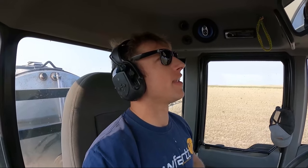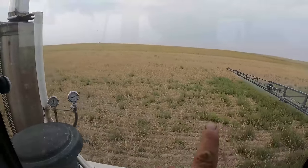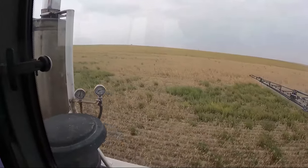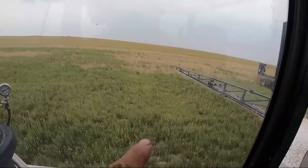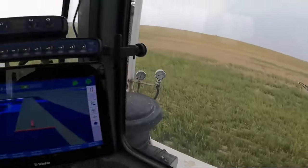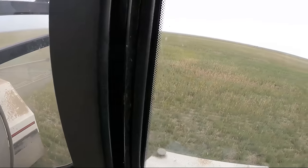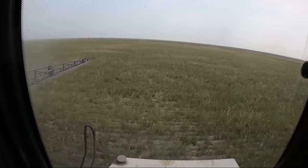Something you guys don't see - I watch each video two or three times a week before I post it, just to make sure it's good to go. Sometimes it's like, I don't want to sit down and watch my own video, but I have to because it's important. Now spraying this stuff - tiny droplets, misting, trying to cover every little bit of green kochia. I've got it set almost 80 PSI - that's high, typically I spray at 40 PSI. I'm running twin flat-fan non-air-induction nozzles so there's a stream going both ways, forward and back, hitting the front and back of the plant. Max 12 miles an hour.